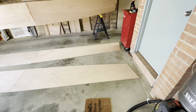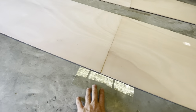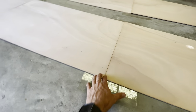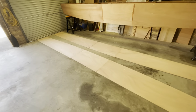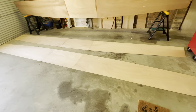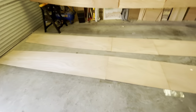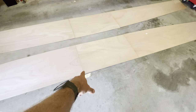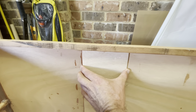The next hull panels are on the floor. I've got some clear perspex underneath to make sure the epoxy doesn't bond to the concrete, because that would be disastrous — there'd be a lot of mess grinding up concrete, plywood and epoxy. Now I need to cut up my timbers for my butt joints, just like on the inside of the hull. Those pieces there are 150 mm wide.